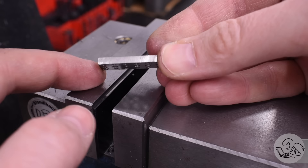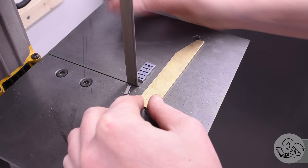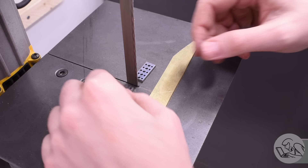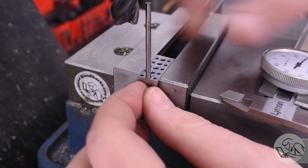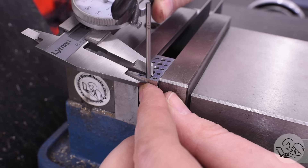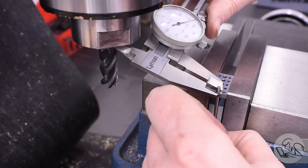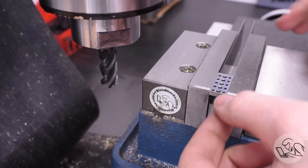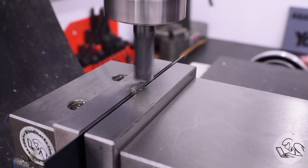I kept the spacing between holes pretty tight; if I were doing this again I might leave a little more space. I also chamfered the tops of one side of each hole to give clearance for silver solder. To figure out how much to remove from each bandsaw cut, I'm using a gauge pin in the hole and measuring with a caliper from that. It's not super accurate but it's accurate enough. If you really needed the holes to be absolutely perfectly centered you'd drill them after cutting everything to dimension — a method like this is never going to be as accurate as that, but it's a lot less work.